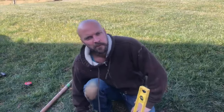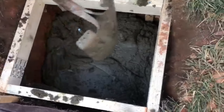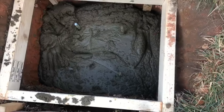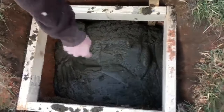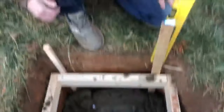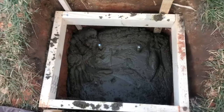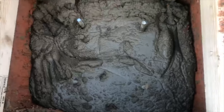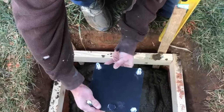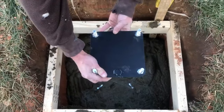We're pouring our in-ground basketball anchor. The hole is 21 inches square and 30 inches deep. After you get about 18 inches from the top of the hole with concrete, you put four pieces of rebar in. The J-hooks go along the side of the rebar — between the rebar and the J-hooks it'll be really secure. Then you fill the hole back up to the complete top and wait a couple days for it to dry.